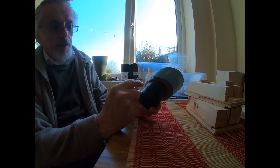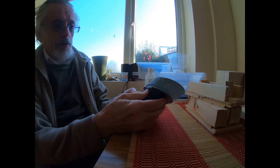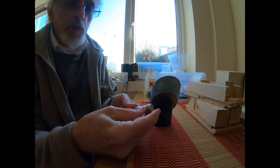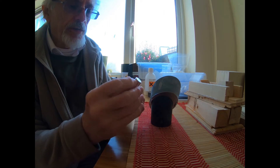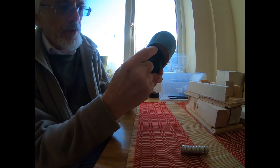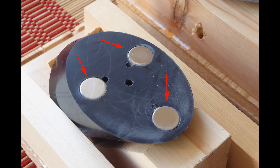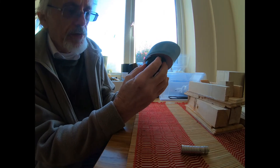This support has got three little holes drilled into the surface, and I have put neodymium magnets in — here's a pile of them. They're about 15mm across and 3mm thick. So there are three of those recessed into the support, glued in with araldite and a very snug fit.